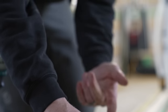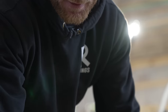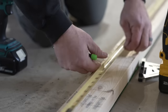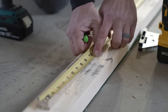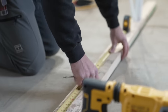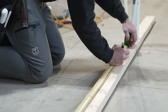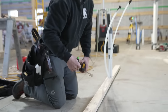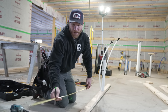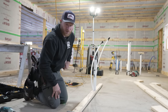I need to find the accurate dimension of this double door. Here's a trick I always like to use: I'm measuring out a 62-inch rough opening but I'm going to put my tape at 10 inches because it's not always easy to be exact at the very end. 10 is an easy number to line up with, and then I just add 62 to 10 — which is easy math, 72 — and that's my rough opening mark. I think 10 inches is easier than starting at 12.